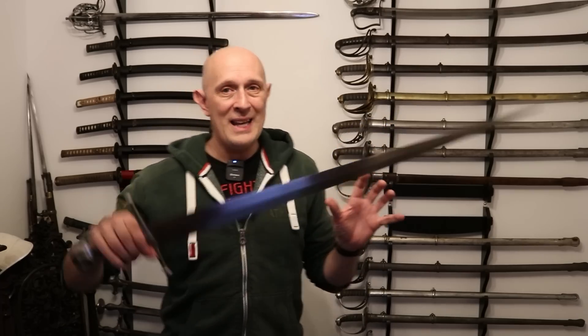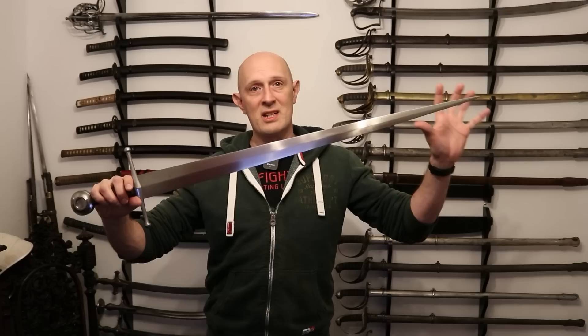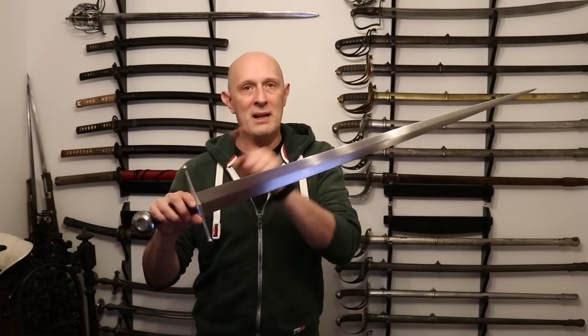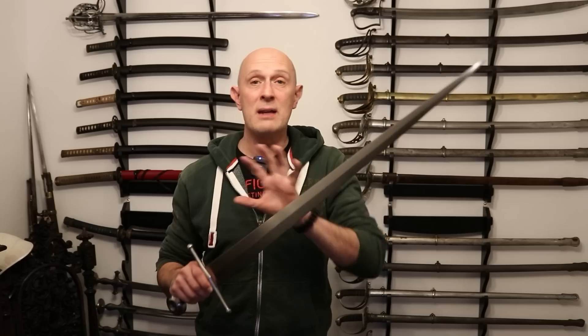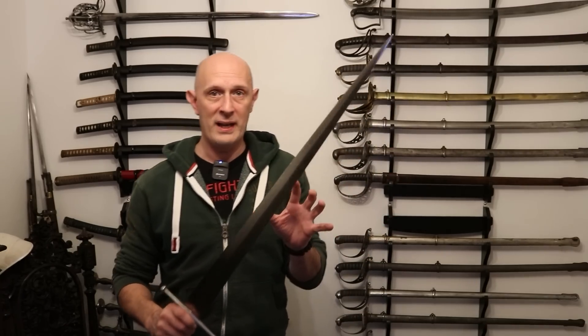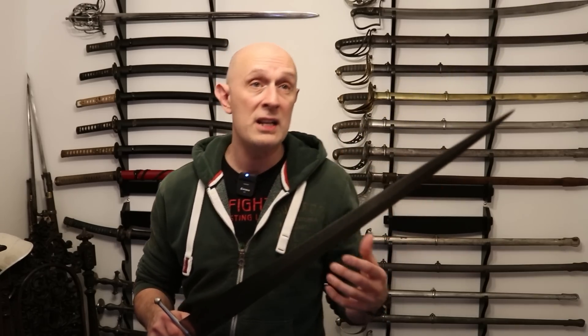The main reason for that is that if you make something with the characteristics of a sword — if you want it to be able to cut and thrust, or just do one or the other — you'll often end up with a balance point around here. If you put it too close to the hand, it will actually impede it being an effective weapon. Even for thrusts, if you balance it very close to the hand, you might think that will make the point very nimble, but what it actually does is give you no feeling in the blade. When you hold a lever like a long stick in your hand, you have a certain feeling in the blade. The closer you bring the point of balance to the hand, the less feeling you have, and the less you can control the bind against an opponent's blade.